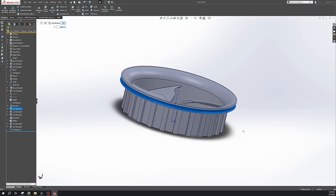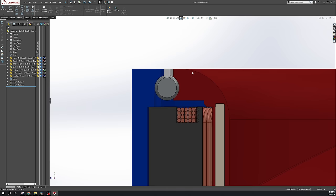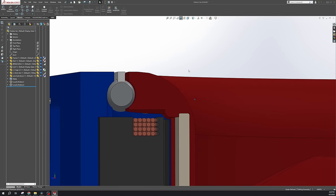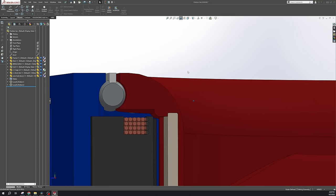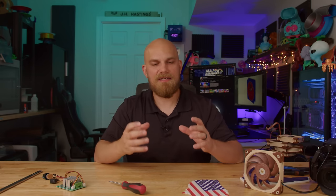I also added that same raceway on the top of the fan disc around the edge. I left just enough space with them assembled that I hoped that it would hold the fan in place without very much slop, but still being loose enough to allow it to spin freely. However, keeping the ball bearings evenly spaced meant that I was gonna need to add a cage.